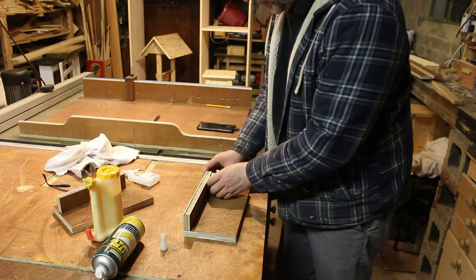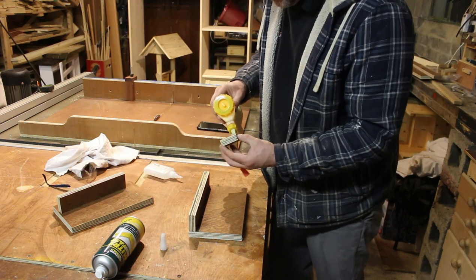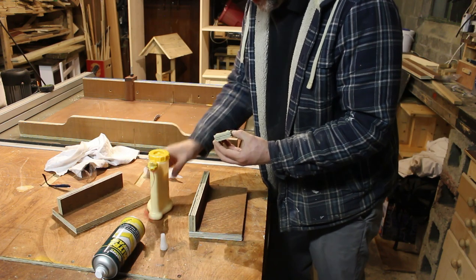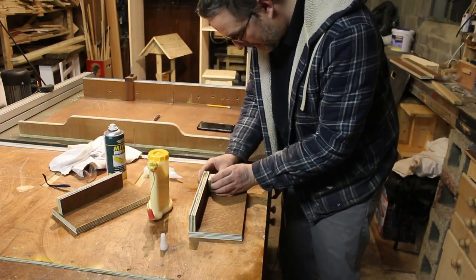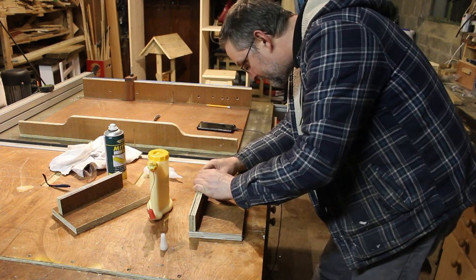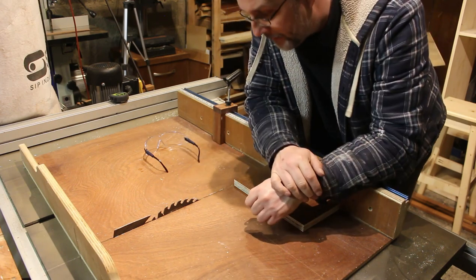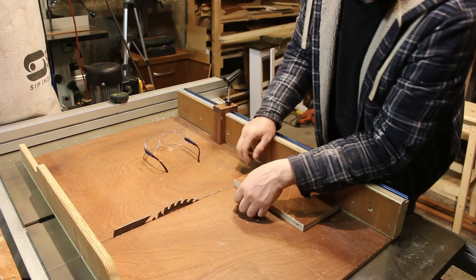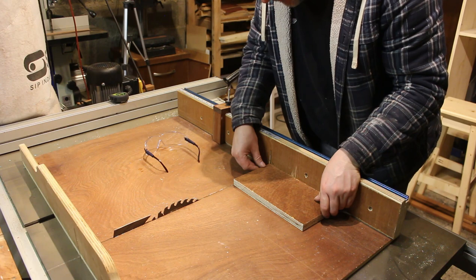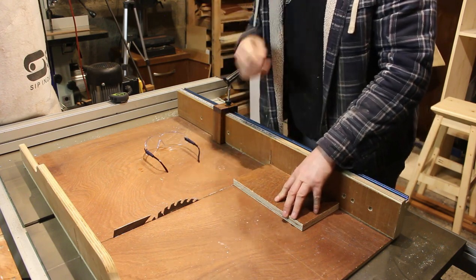This little piece that I cut earlier on I'm going to glue to the very end. When you're making pens and you've got your pen blank, you want your pen blank to be slightly longer than the actual pen tube itself. That way you can use your barrel trimming tool to get everything nice and flush. To make that little offset I'm just going to cut this top slider piece just a hair's width — just enough for the blade and a little bit more — and that will give me a little bit of offset either end of the barrel tube for later on.